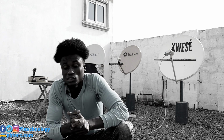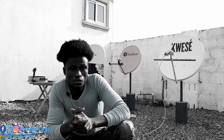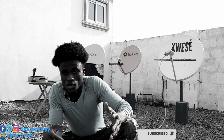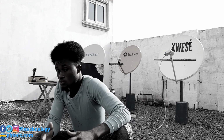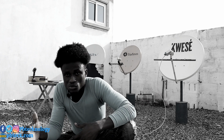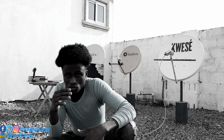In this illustration I'll be using the DSTV transponder, but you can use any TP at all. Just change the TP from the DSTV TP to the FTA TP that you'll be using. All you have to do is the settings in the installation or dish setup on your plasma TV, and then start rotating your satellite dish around to get a signal. So let's start.